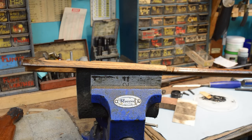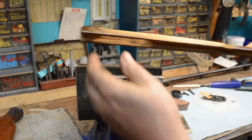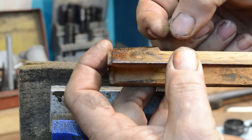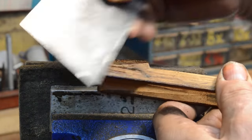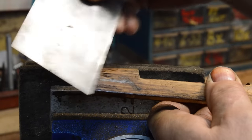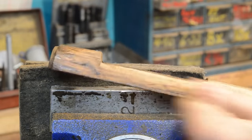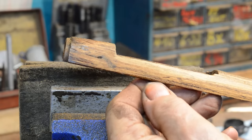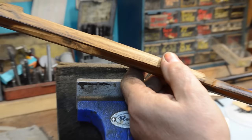Back to the light scraping. What I'm making here is not sawdust — this is actually powdered whatever this GAC is on the top. We don't want to make the wood naked if we can get away with it. We don't want to be taking off any inspector's marks or unit marks. All we're doing is very, very lightly removing the outer finish. There's enough oil in this thing that if I run my thumb on it hard enough, color will actually start to come down a little bit — I'm actually burnishing it with my thumb. So you have a lot to work with here without completely messing this up. We're not going to use a lot of sandpaper on it.